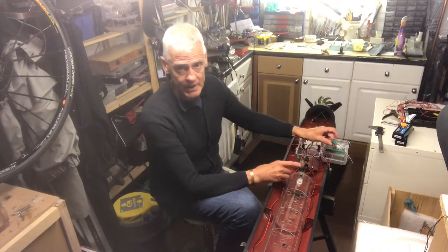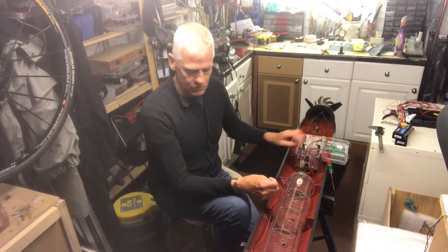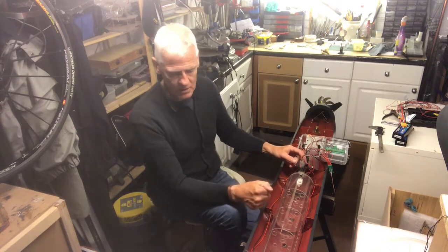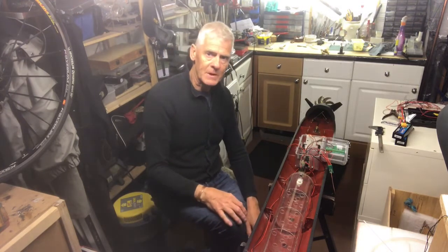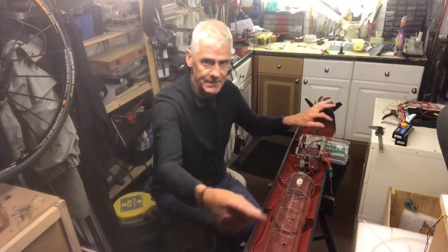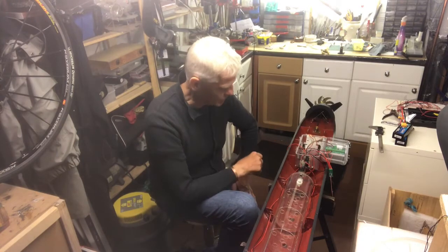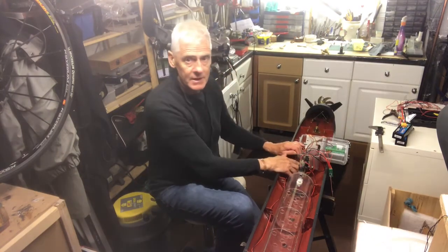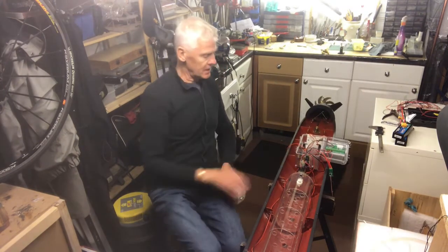At the moment we have this distribution panel here ready and waiting. I've just started putting on the electronics — connecting the air pump and solenoid valve to one of these latching switches so I can control them from the transmitter. Down will open the solenoid valve and up will give me the pump. A little switch on the side will let me open the snort valve. More wires are coming in for the light and power for the conning tower. We're using these waterproof glands throughout.